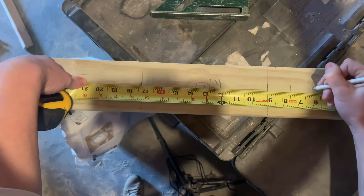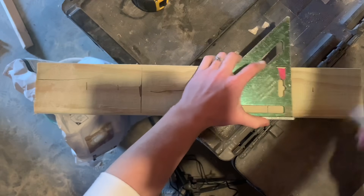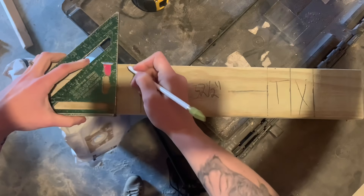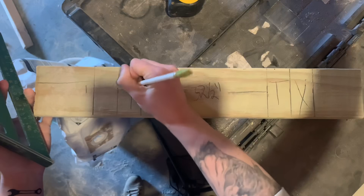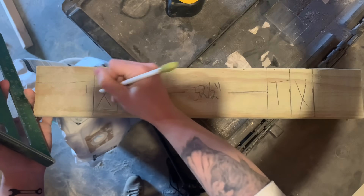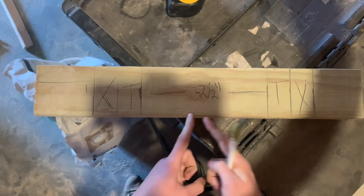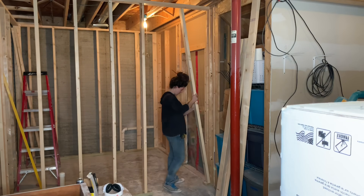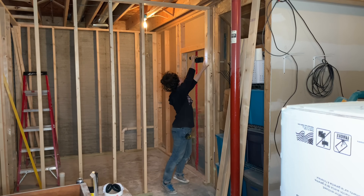Next, you want to mark out an inch and a half and three inches on each side of your rough opening. I'm going to go ahead and square across both of these lines. My first inch-and-a-half space is going to be my trimmer, so I'll mark that with a T, and my second inch-and-a-half space is going to be my king stud, so I'm going to mark it with an X like all of my other studs. So that's an inch-and-a-half trimmer on either side of my rough opening and an inch-and-a-half king stud on each side of either trimmer. Once I have my layout figured out, I am ready to install my king studs on my X's.